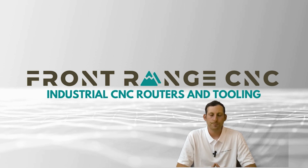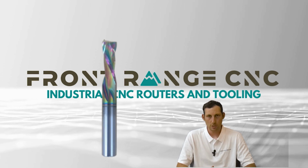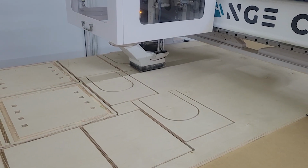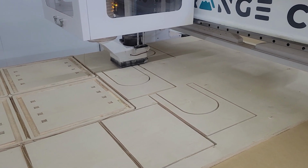The third style is a compression bit. Now, a compression bit is a combination of a down flute and an up flute, and it's almost exclusively seen in plywood. You could still use this style in really any softwood or any material that would potentially tear. So, think about the bit is shaped closer to this where it's got both, but depending on the height, you are going to engage the up flute or the down flute at different spots of your tool path.